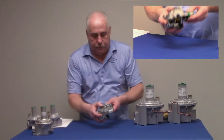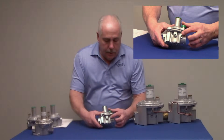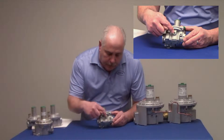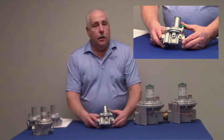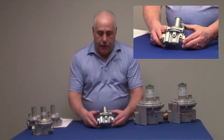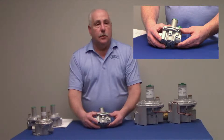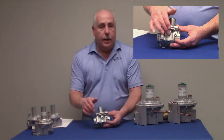Now, the taps on the unit. On all of our standard units, there are taps but they're not drilled out. So if you're going to monitor either the input or the output right at the gas regulator, take either a one-sixteenth or one-eighth inch drill — something really small. Take off the bottom, make sure there's no debris in there, and then do your readings. Once you're done, take a one-eighth inch NPT plug and plug them up.